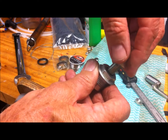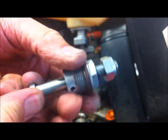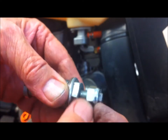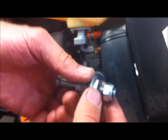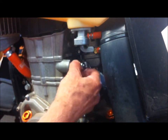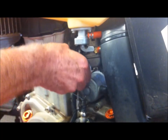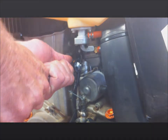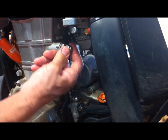We want the o-ring to sit in that little recess in the cap. Then we'll put our lock nut on. I've screwed it in as far as it'll go and then wound the nut down so there's enough protruding to grab that end with the 8mm ring spanner. Now we can put this in — remember the copper washer.